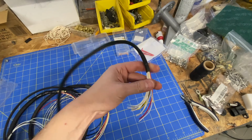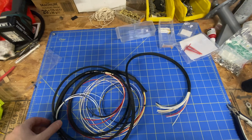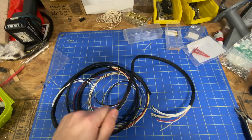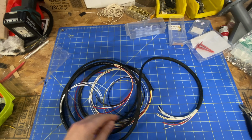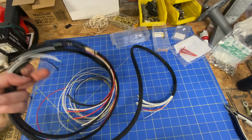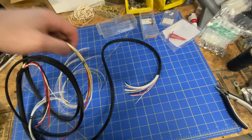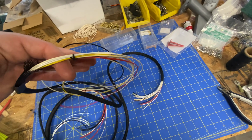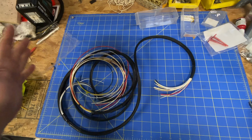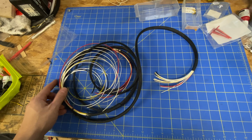So we come off of the electronics tray, we have a connector here, which obviously none of the connectors exist yet. We come forward and we split off to our various things. This stuff does offer some chafe resistance, and it's also just a pretty item to cosmetically clean up the front of the airplane. There are some open wires, obviously, especially in the center section, but the vast majority of that is hidden underneath the console, so you're really not going to see it. There will be some exposed wiring up at the end, that's up at the Dynon behind the instrument cluster, so not a big deal there either. Obviously, I have more work to do, so let's see about terminating this sucker and getting it in the airplane.